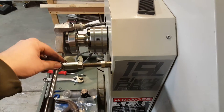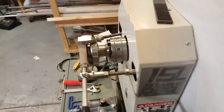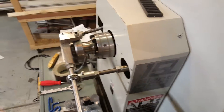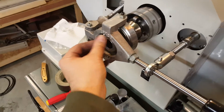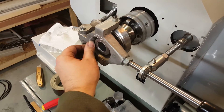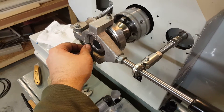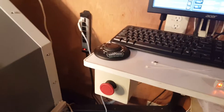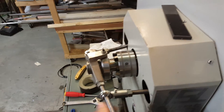I haven't got the bar puller exactly figured out yet, but that will be coming. For right now I just have to feed the stock in and make sure it feeds in, so it's not fully automated but we're working on it. I also die-ground down this part of the stock closer right here, so that whenever you're loading stock you can still spin this freely — it's not actually touching anything.